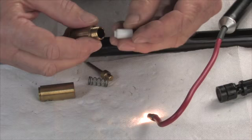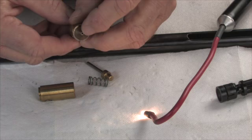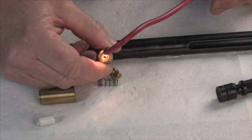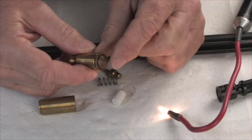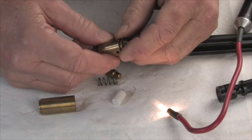The second place you can have trouble with these guns is the check valve. The check valve just seats up there and keeps the air from flowing back out toward the pump cup through this hole. If you've got some debris or a nick or a gouge on the inside surface there, that'll affect how well your check valve seals. And if you get something on the check valve itself — a nick or some debris — that'll affect it too. What'll happen is air can escape back out here while you're pumping, or it can leak out gradually over a period of time.